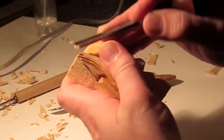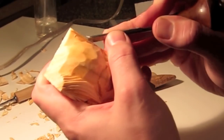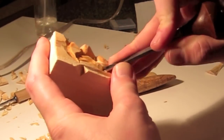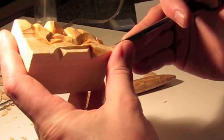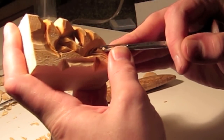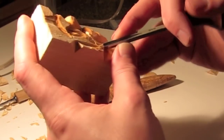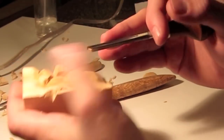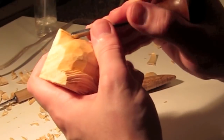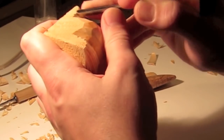We're going to stay with a very basic, stylized hair direction — not real detailed, pretty large strokes. Keep them uniform and even. When you're doing hair, try to get your strokes to go consistently and have a controlled push through a certain amount of wood so you have control. You can see now that the alcohol has soaked in — it's just carving through there like butter.